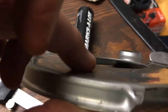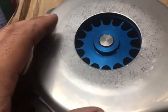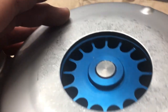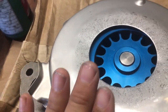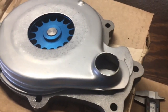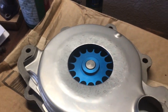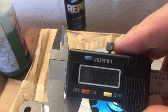That impeller is so short that I'm going to have to keep working this metal down to almost make it concave - that's what I'll do. I'm getting this shaped the way I want to close that gap, and I'm almost there. You can see now it's concave - I had to take all of the slope out and it actually goes down now. Going around with the hammer on the floor works, but what really worked best was carefully pressing in there and following it up.